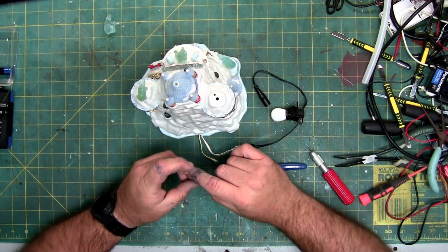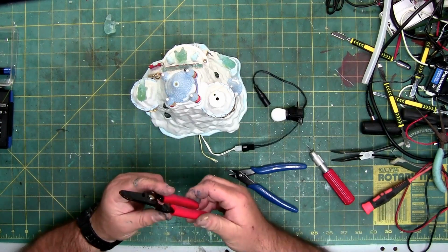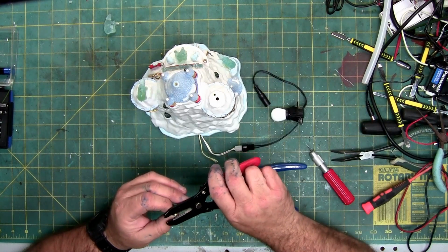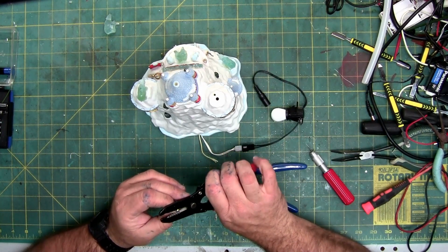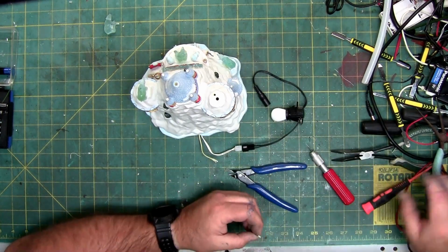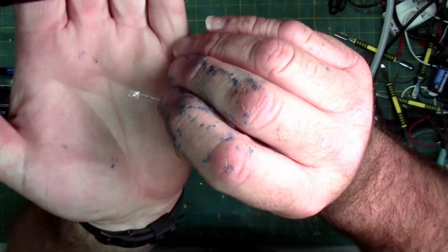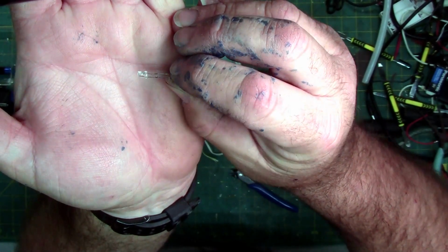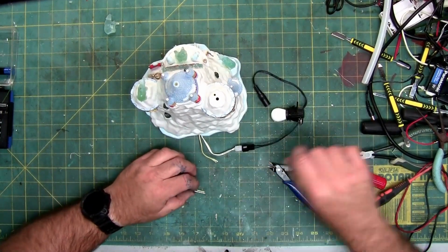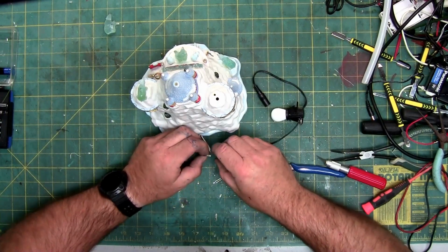And you can crack these, meaning you can make them flat top, with something like a pair of wire strippers. If you do it wrong, though, the light won't work and you'll have to replace the LED again. So I'm going to chip the top off to make it more flat. Like that. If you go too deep, it'll expose the inner core. And now you can see, maybe, it's no longer rounded. If you want, you can just buy straw hat LEDs. That's up to you. I just break the tops off myself and we're good to go.